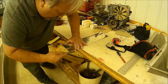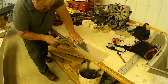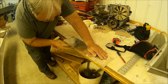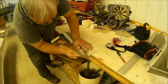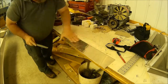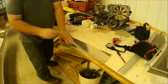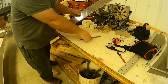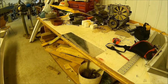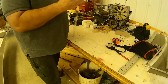Right now I'm using a file to deburr it because there are sharp edges on there and sharp edges are bad when you've got a cloth-covered airplane. I spend quite a bit of time smoothing this out with a file, taking off the burrs, flattening it out, and removing the sharp corners — I'm rounding them off. If you're going to be doing this yourself, definitely make sure you smooth it off. You can see me running my hand across it — if I don't cut myself, I know I've made it nice and smooth. I was running for some sandpaper.